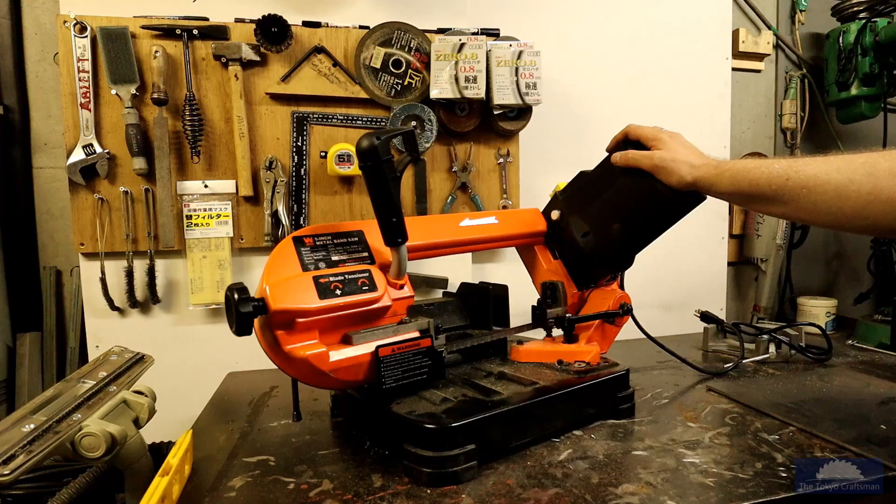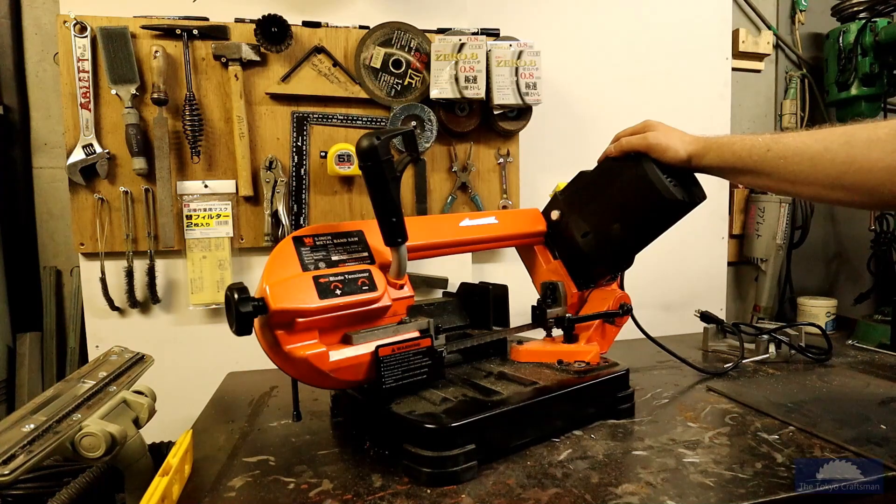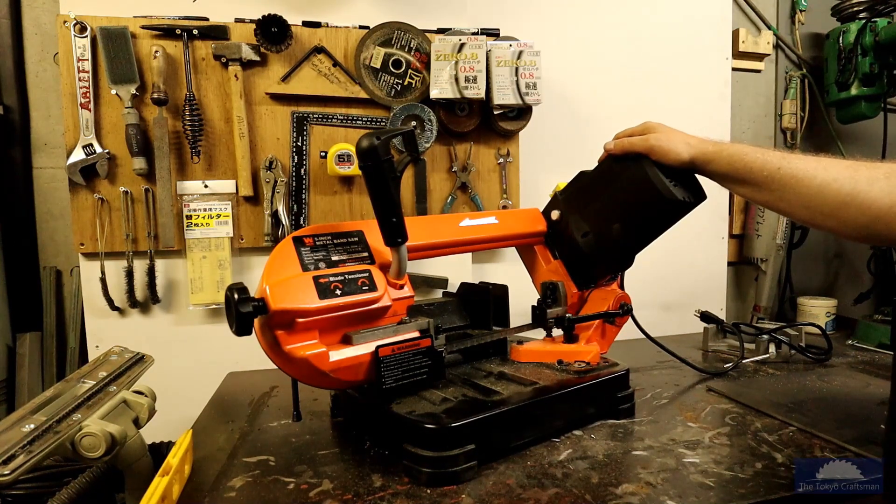I've already used this on one job and found it was quite good. I wanted to get it because it's a lot less noisy than a metal cutoff saw. I have a big slow-speed saw with a metal cutting blade and it cuts more accurately, especially on 45s. With a large 14-inch cutoff saw, even with a carbide tip blade, when cutting tubing on a 45 it always deflects — the top of the cut is off from the bottom, making it really hard to weld up. I bought this hoping it would solve that problem and it seems to have.